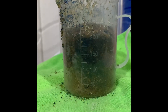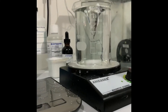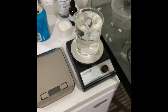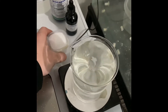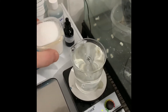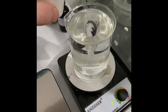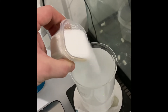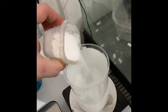The first thing you need to do is measure out your DI resin — I'm calling this 250 mils of DI resin. You need twice that amount of water, so I have 500 milliliters of DI water here, and that 500 mils of DI water requires 88 grams of sodium hydroxide. This is going to get extremely hot, so you need borosilicate glassware. Go ahead and add it in, let it get to stirring, and we'll speed through this process.